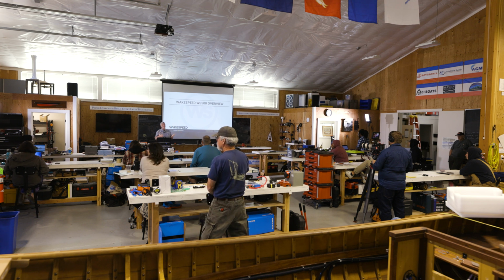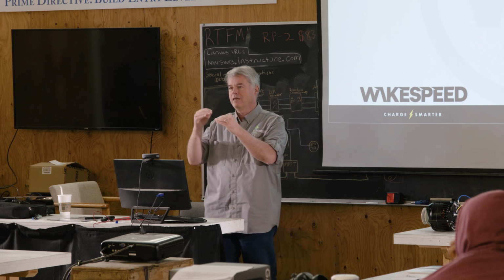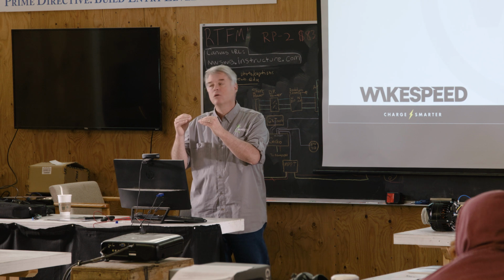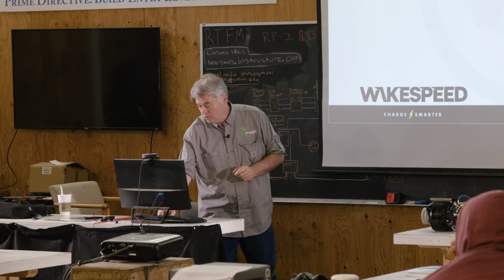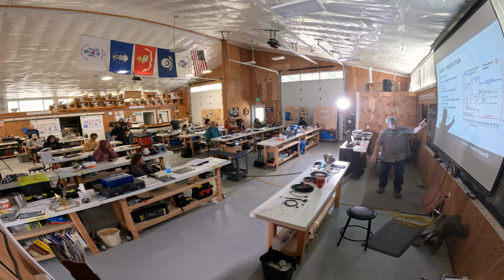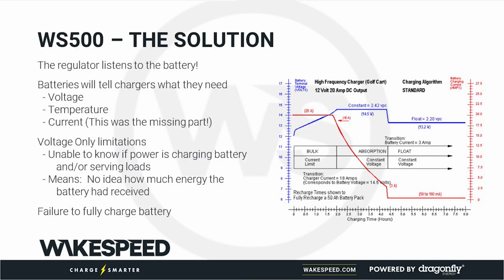Another function that the BMS often does is balancing. So you've heard that, as the cells get charged, you have to do balancing a bit. Typically what we see is what's known as top balancing. When you get to this portion of the charge process, most BMSs will trigger around 14.2 volts. Their terminal charge is usually 14.4. Once the battery gets above 14.2, the top balancers will be enabled. Every battery is a little different, but that's pretty common.